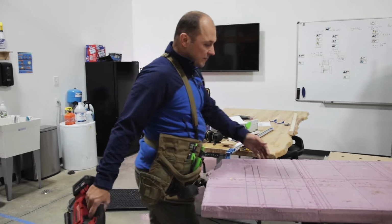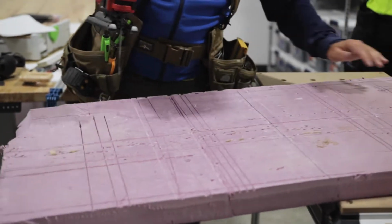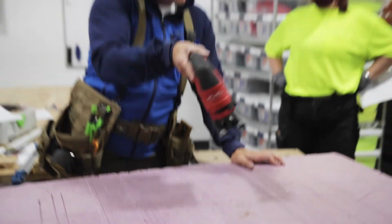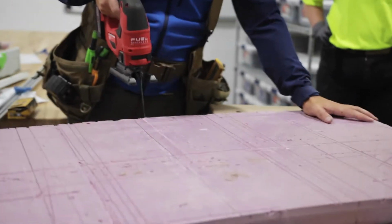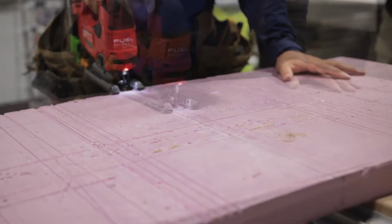So anyway, I'll go over here for Dennis. There is no jig that will help, because if you put that brace on here, you're going to be pushing this way. What's your blade going to do? It's going to want to cut the opposite way. Follow your line. Leave your line, cut on the inside of your line. Again, it's so small, right? Get over here. Again, this is kind of one shot, one kill. You don't have many chances.